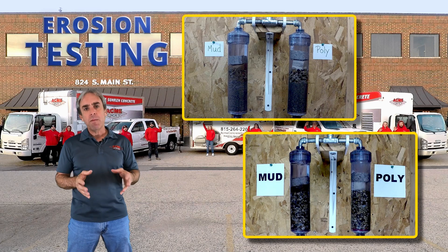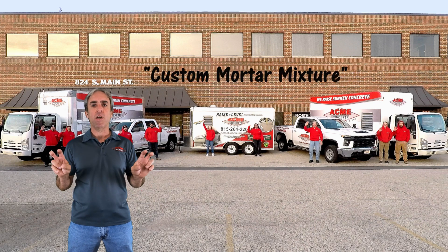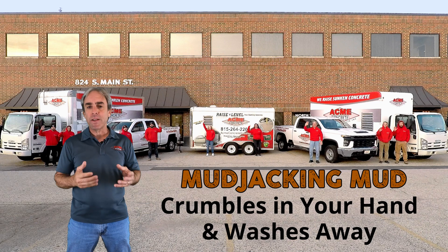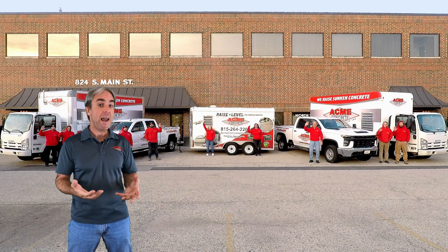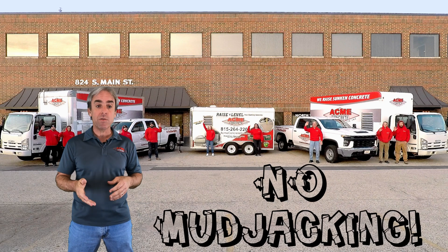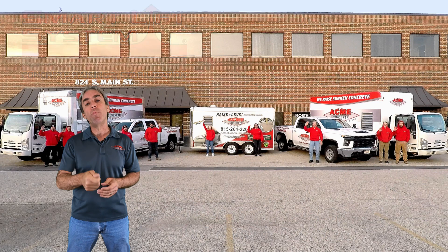Mudjacking can be referred to as a cement-like clay-sand mixture, or even a custom mortar mixture — but it doesn't matter what they call it. In our experience, it all crumbles in your hand and washes away. If something crumbles in your hand, there's no way it has a compressive strength anywhere near suitable for a long-term repair. We would never use mudjacking materials — we only provide polyurethane as a repair method for sunken or unstable concrete.